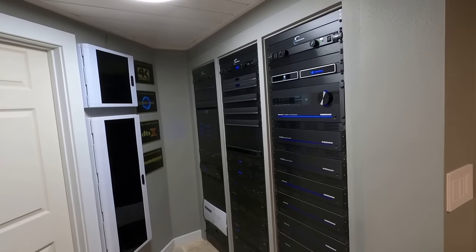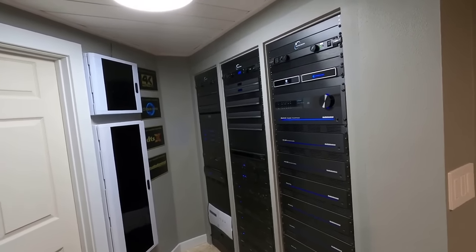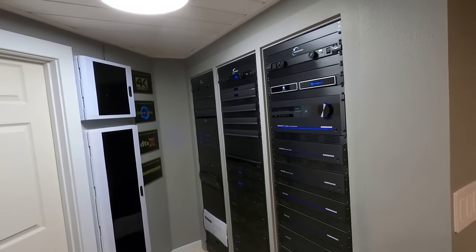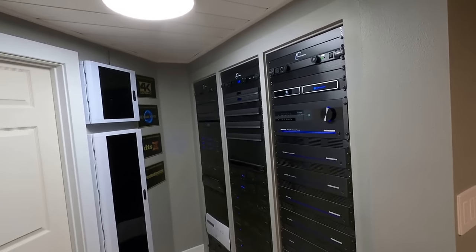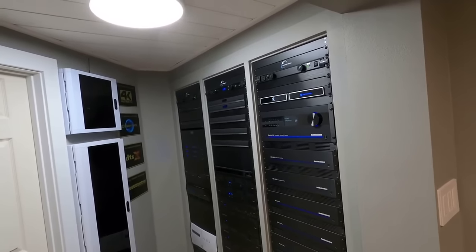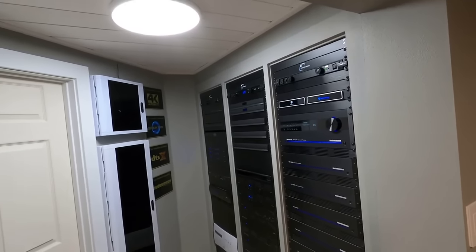The V is video out, so the video out goes into the HDMI switcher, and we'll end up having a kind of a page on it to alert us of doors open and close, HVAC temps, kind of a neat house system that we're putting in with that. It's not 100%, it's probably about 80% done.